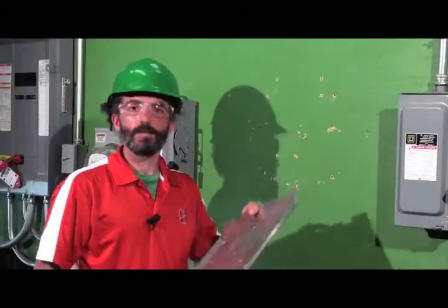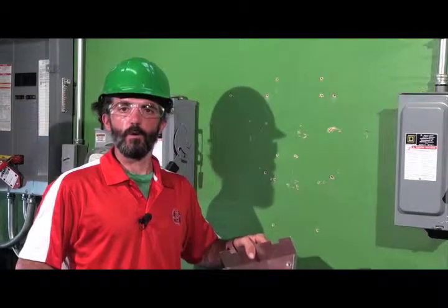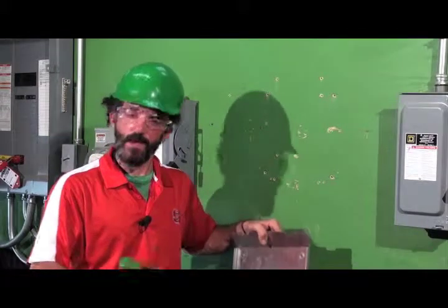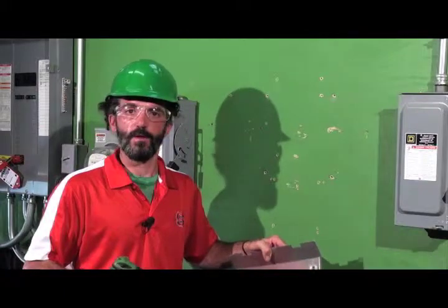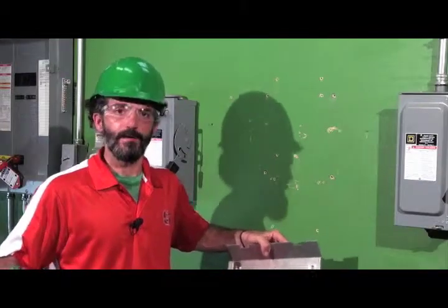All right, we have our mounting plate. The inverter manufacturer, whichever the company is, they're going to have their own requirements for spacing in terms of what space they want below or to the sides for cooling. Some of them use fans, some of them don't, so you just need to check with your inverter manufacturer and follow their specifications for spacing. All NEC electrical clearance spacings still apply.